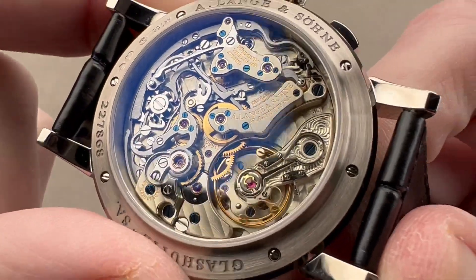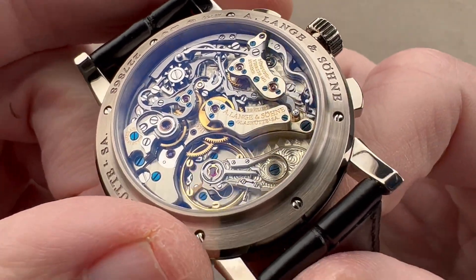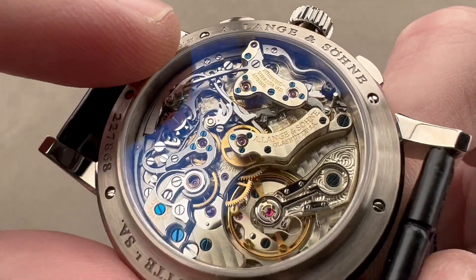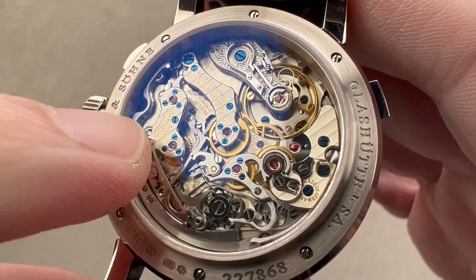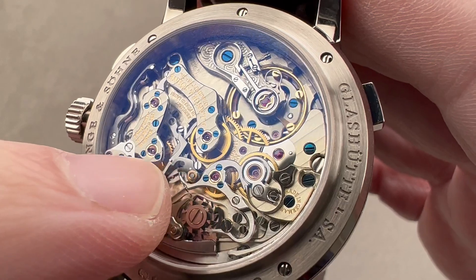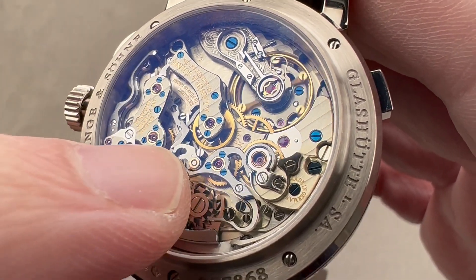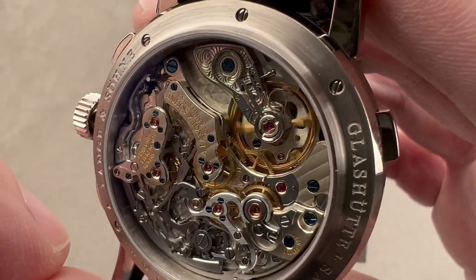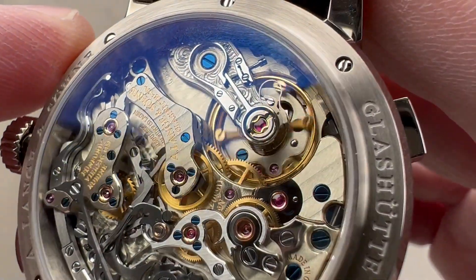This watch is made in the state of Saxony in Glashütte. We have stripes across the bridges, engine turning on the base plate, and a Lange signature: the use of a freehand engraved balance cock, so no two are exactly alike. All the steel components feature satination across their tops. In a loving nod to the pocket watch era, quite a few pivot jewels — including on the chronograph clutch — have been set in golden chatons, which are themselves fixed in place using screws. The precision chaton would be cut, the jewel pressed, and then placed into its cradle in a slot held by screws. It's a nod to antiquity — not necessary today, but Lange is all about reminiscing about the past. There's lovely snailing on the bridge for the escapement just below the balance, a wonderful piece of attention to detail that's overlooked on even many high-horology watches.